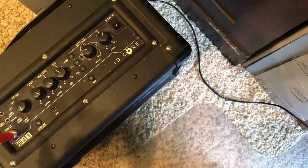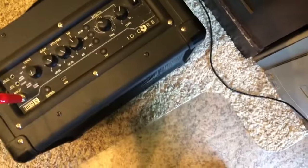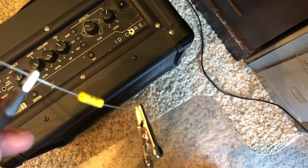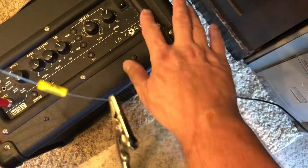It makes a big difference. So always hold the negative in your hand, because if you hold the positive, it's going to sound really noisy. Also, the smaller the capacitor, the lesser the capacitance, the more noise you're going to get anyway.